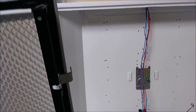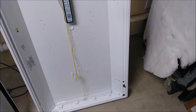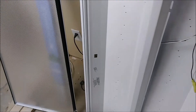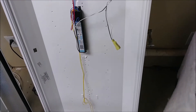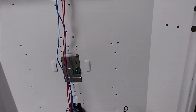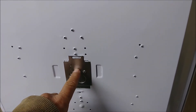Here is another thing — you can remove this door easily before the installation. To remove the door is very easy; there is a latch here that you can just pull out, and that's it, it's out. There is another piece of metal that I already removed — it was a cover sitting here to cover the ballast. I removed it, and I'm going to reinstall it when I finish the installation. The first thing we need to do is knock out one of these circular pieces of metal from the back.